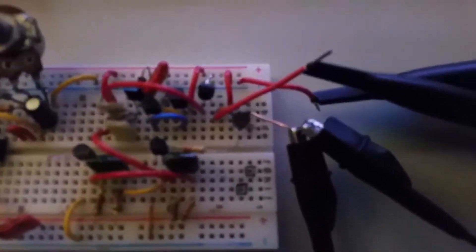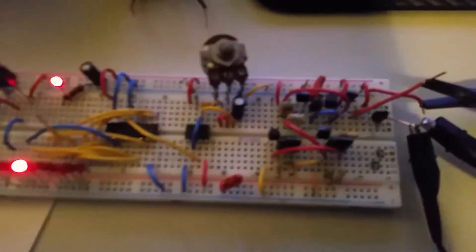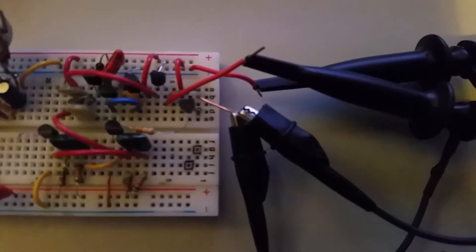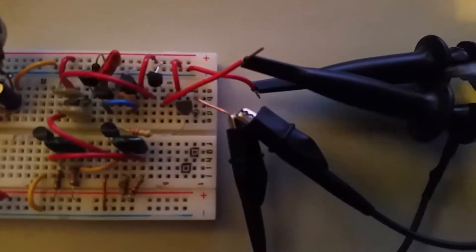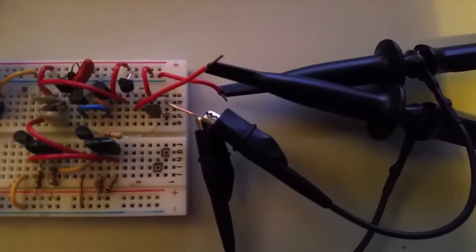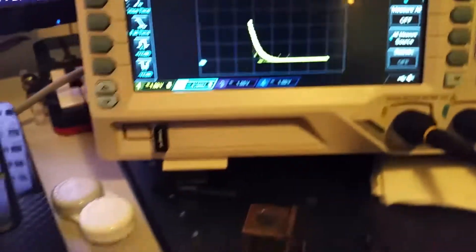As you can see it's very simple — ignore this part, it isn't part of the circuit. This is the circuit and this is my transistor under test, it's a BC547. I think you can also do diodes — it goes in the collector-emitter and they have a nice trace.